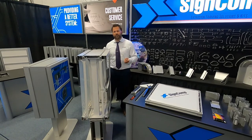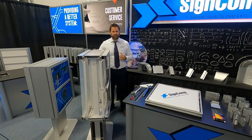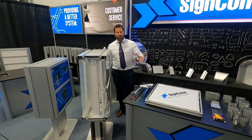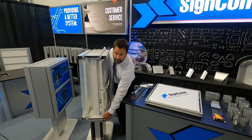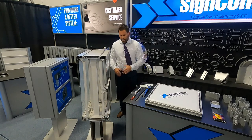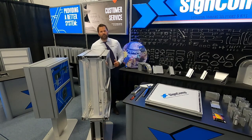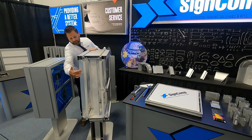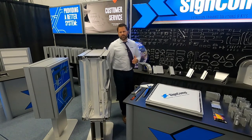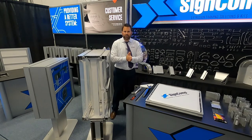Also in the commercial line, flex faces — rigid and flex — still hinge open for service. We're going to ask what kind of face material you're using, which leads us to commercial for flex faces. This cabinet is actually very unique — it shows the inner workings of our extrusions. All of our bodies have inner flanges, and with this commercial setup we're showing you where to put the plates inside the cabinet. Once we get into hinge faces and the combination of flex, that's where our frame support tubes come into play — when we hinge that open we want the face nice and taut and square so it's easy to close after servicing.